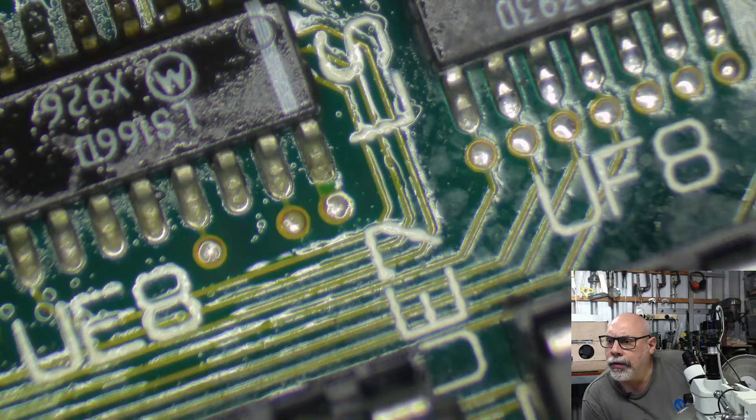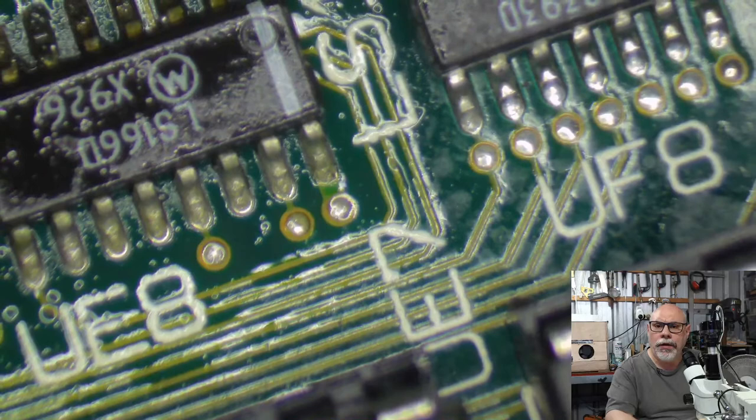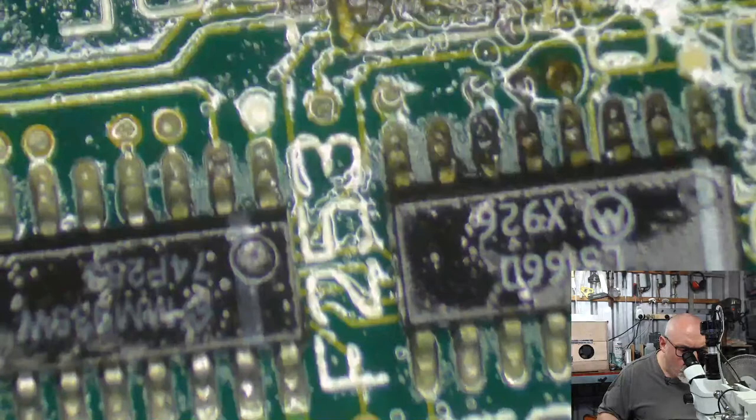Okay, so I've been quite lucky with my board repairs. Looks like the leakage might have gone under those ICs. Would ultrasonic cleaning and scrubbing get rid of it? Ultrasonic cleaning would be better, because it cleans in nooks and crannies because of the way that it works. As long as the area is under the water of the ultrasonic cleaner, it will get cleaned.